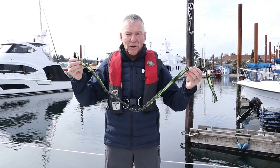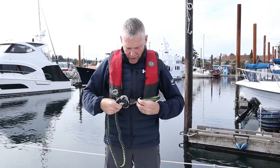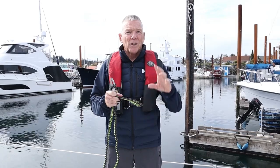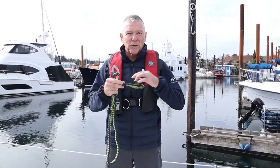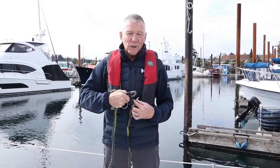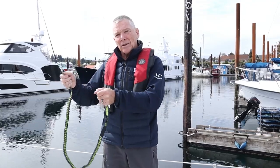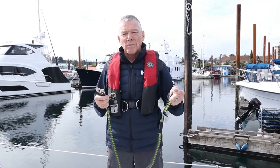This is a six-foot tether, but because there's a bungee inside, it'll stretch, making it less tether to deal with once connected to your body. Most tethers are six feet long, or you can get double tethers with a three-foot and a six-foot leg. Most will have a clip at the body end that cannot be released under tension, so again you need a cutter. With a double tether you can leapfrog along the boat, or clip yourself in short at the mast.